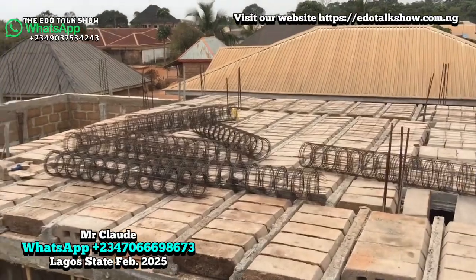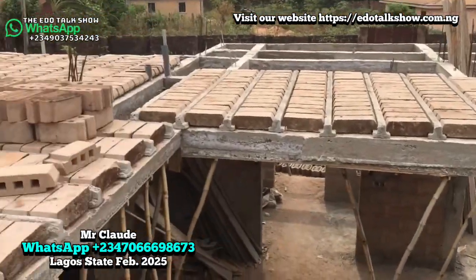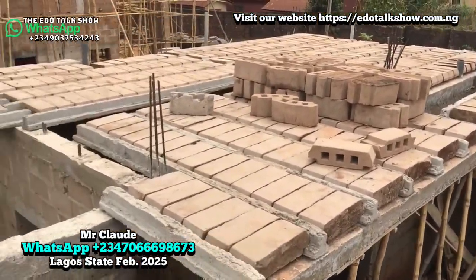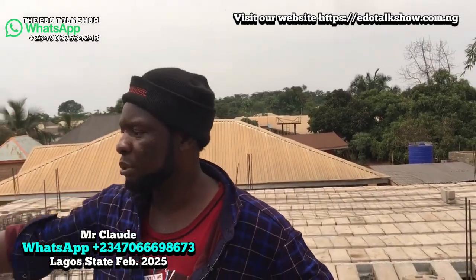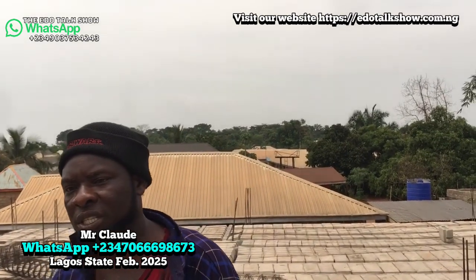Our viewers all over the world — thank you for the time you give us to watch our videos, and the motivation you give us. God bless. This work will finish before the end of this week. Yes, because I'll carry the t-beams tomorrow, place them, lay the blocks inside, then call a carpenter to knock wood for the surrounding — there must be a wood for the surrounding for casting the other side. Then complete the job. The casting on this: how many inches? Two and a half inches — latest maybe three inches. The normal traditional decking is almost six inches.